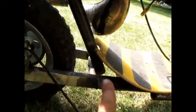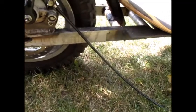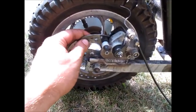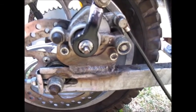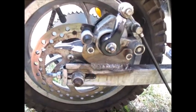The motor sits up — there's a piece of steel pipe here that leads up to a motor mount, and that's how the motor mounts up. This is just the rear swing arm; I took it off the little dirt bike, chopped it up, and basically made it work so I could weld it into the frame I built. And there's the brake — it's just the disc brake off of the original bike. I had to cut the caliper mount off and move it back about three quarters of an inch and then weld it back onto the frame.